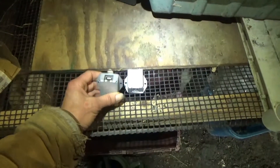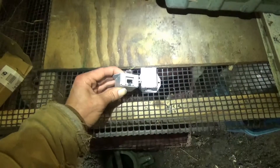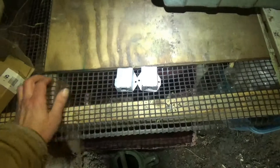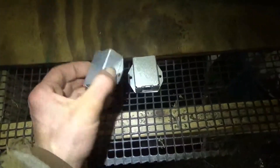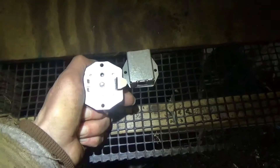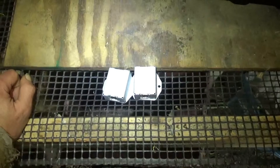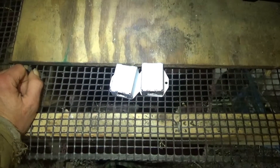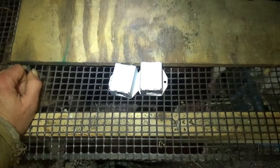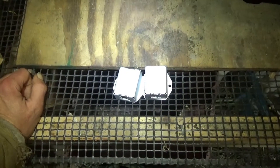I'll be using these lightning arrestors to make the jump, which would be nice — able to ground each end of the cable at least. They're nice little devices and I'll be setting these up in the next couple days or week or so. Thanks to my good friend Aaron — I recommend putting lightning protection in if you're running Ethernet cables outside.